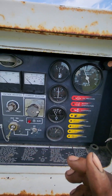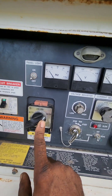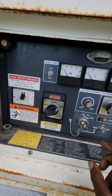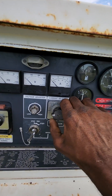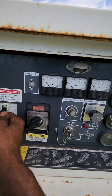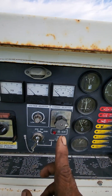This one is reading amps — we won't read amps yet, but that's actually working. Now this is your voltage selection switch. This should never be turned while the generator is running. This one reads what voltage is at each phase — there's nothing. Nothing. Breakers are on, but no voltage at all.